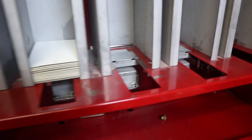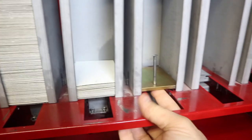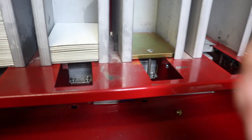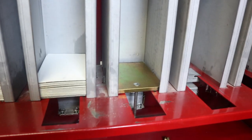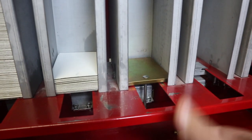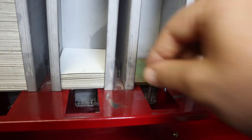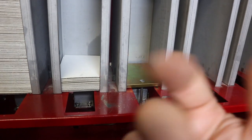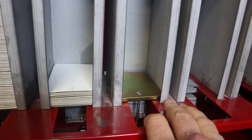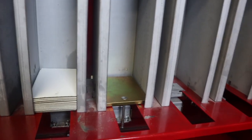Let's say you sell out of stickers. Once the last sticker is gone, this pin drops down and that doesn't allow the quarters to come into the machine anymore. This little pin stops the coin mechanism from moving forward into the machine — it locks up the coin mechanism so that customers don't lose their two quarters, because that would really upset a child.